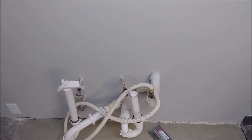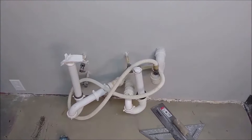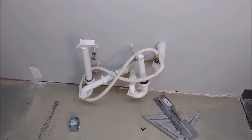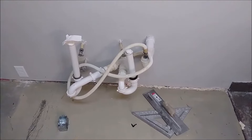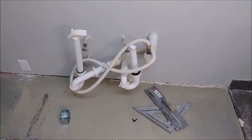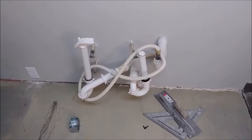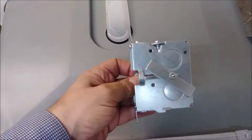I just want to show you how I'm going to install an outlet for the garbage disposal. That outlet has to be metal because of the water environment. It should be metal even though some people use plastic — just so you know, the plastic you cannot ground, and it's very important for your own safety. This is the metal box I'm going to use.